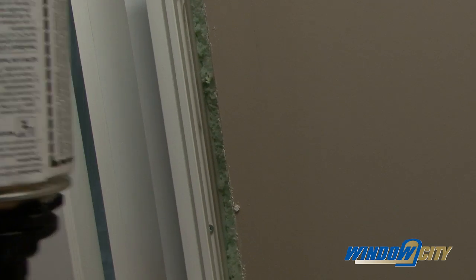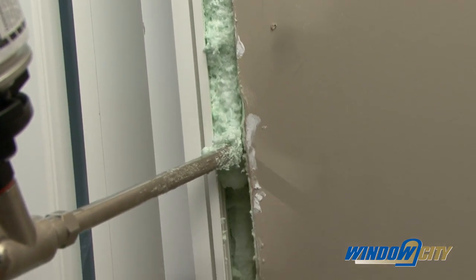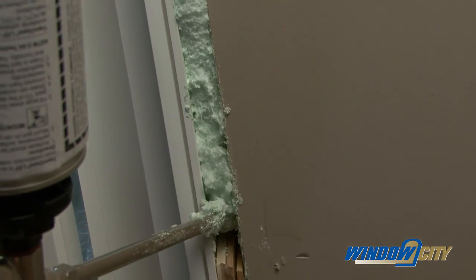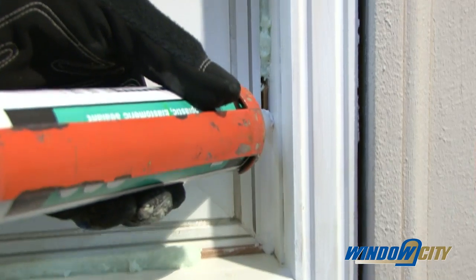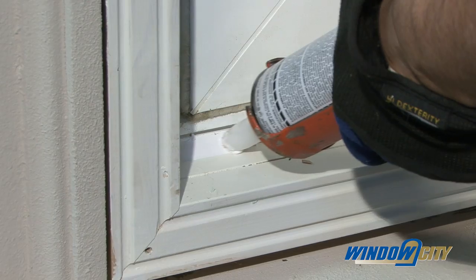The other bead of foam goes near the inside edge of the window frame. If jamb extensions are not sealed to the frame, be sure that the bead of foam covers the joint between the jamb extension and the window frame on all four sides of the window. Make sure you caulk the ends of shims as well for a continuous barrier.